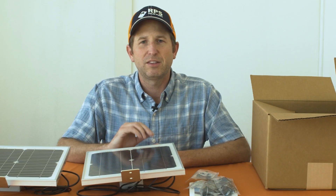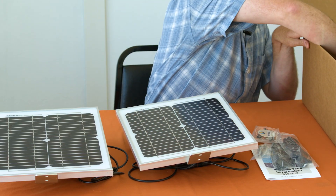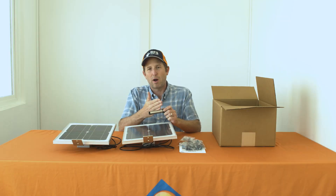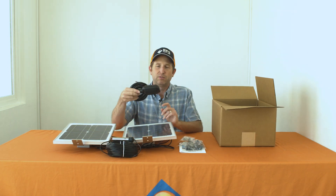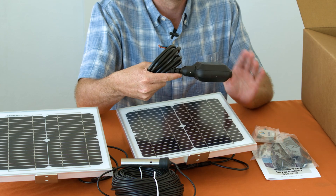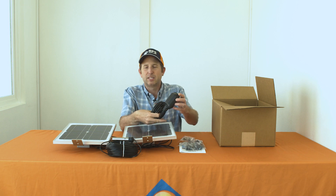For the daytime-only and 24-hour systems, these are generally used with a solar pump or a VFD and soft start, so we're not as concerned about how many times we start and stop the pump since the soft start prevents overheating. For those systems we use a stainless steel probe that wires directly into the transmitter and sits in the top of the tank — any time the water level drops below the probe it turns on the pump and fills the tank back up. For the 120-volt or 240-volt AC system, it comes with a float switch. You can control the throw to prevent the pump from cycling too many times, and when the float drops it signals the pump to turn on, and when the level rises it turns off.